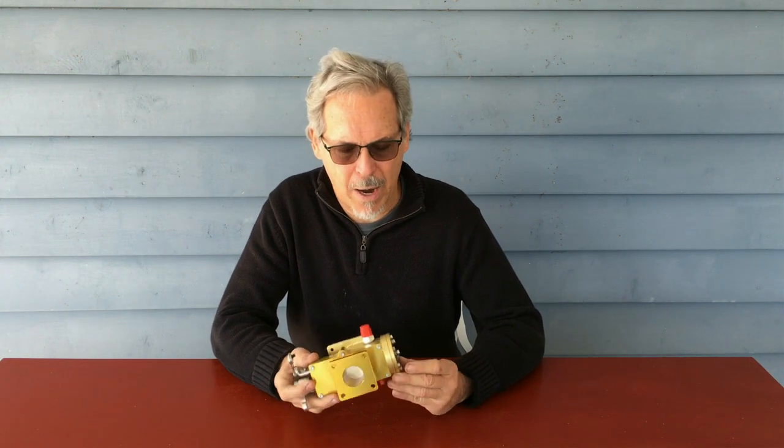This does not require a primer because it has this button on it. It can work as a gravity feed carburetor or it can work as a pressure carburetor — that's the advantage of a diaphragm. It needs no pressure regulator; that's the pressure regulator right there. So it works really, really well.